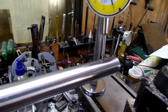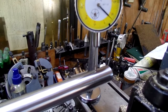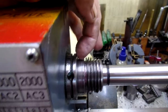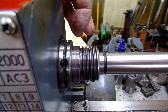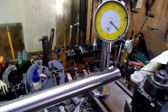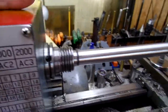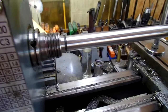Turning the bar gives you an indication of how good the MT3 — the Morse Taper 3 — bore is. You can use the indicator on the spindle and check the face and the register, whatever you want to call it, in both directions. You repeat all this with the indicator on one side or the other to get how far off your headstock is out of true with the ways.